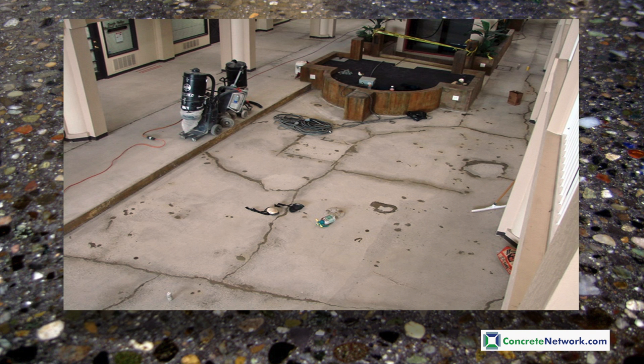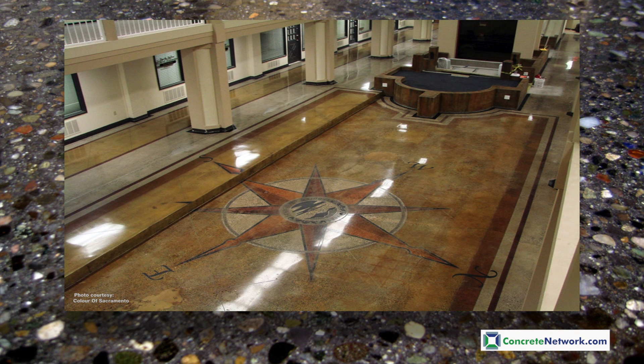This project had a tremendous amount of repairs needed. However, the end result was stunning, producing a distressed looking polished concrete surface. It is important to closely evaluate the floor on the initial walkthrough, identifying surface imperfections like this construction joint. This is a scenario where one pour abutted up against a previous day's pour, creating a stripe across the surface as a result of hand finishing and not machine finishing. This usually requires more aggressive grinding, but often times this cannot be fully removed, especially if the specified profile is a cream finish.